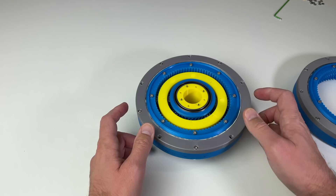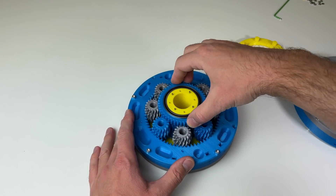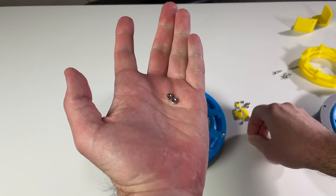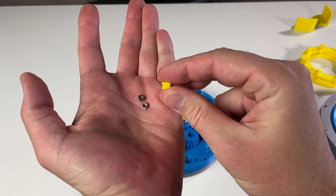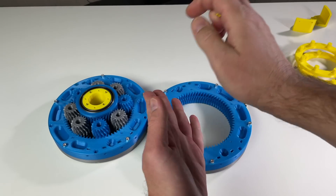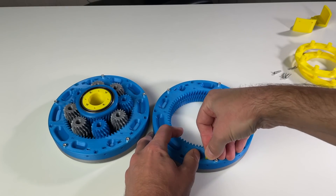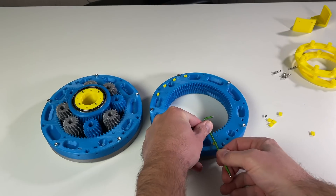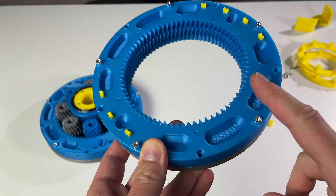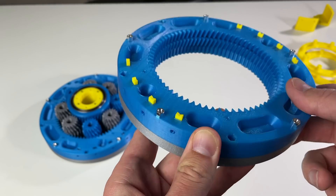I need to install embedded nuts from the other side and on another half — here are the nuts, and here is the small piece that retains them. The nuts go into the slots, and I rotate them in, then use these retaining pieces to hold the nuts so they don't fall when I rotate. There are also other places for dowel pins over here, but I think that's overkill — the retaining pieces and standoffs should provide good alignment already.